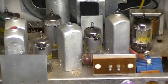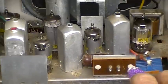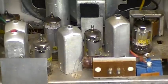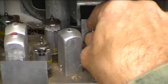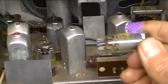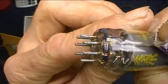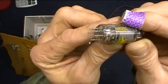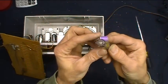Okay, that's cooled down a bit now — no power connected, nothing connected. And this is not a device that is super high power like audio amplifiers for guitars and such, so there's probably not any capacitors in here that can potentially kill me. I'll reach in here very carefully and pull out this tube — kind of wiggle it around and see what it looks like. You see that bit of corrosion on there? So I'm going to clean those off a little bit with some sandpaper, a little wire brush, and take a look at the socket and see what condition that's in.